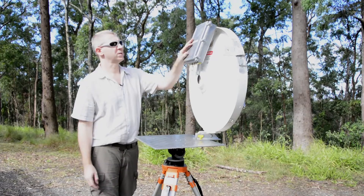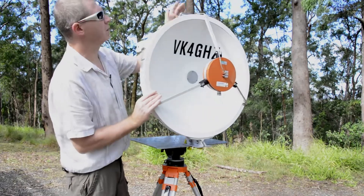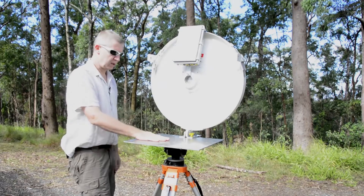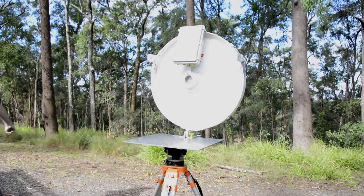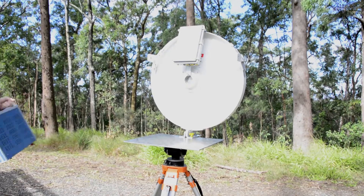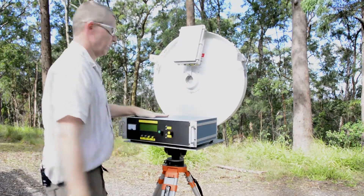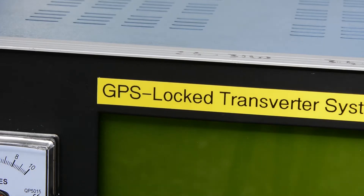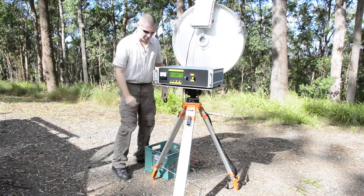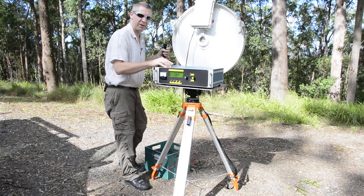The current 10-gig transverter system is in this box up here, and it has a relatively short feed line of 141 down to the feed. On the new equipment tray I'm going to put my 2.4 and 3.4 system — not that I'm using that today — but it has the Thunderbolt GPS unit inside. Out of this unit I'm going to get the 10 megahertz reference to lock the PLL inside the 10-gig unit. Power today is coming from a 12-volt car battery. I'm totally over generators — generally unreliable and noisy.